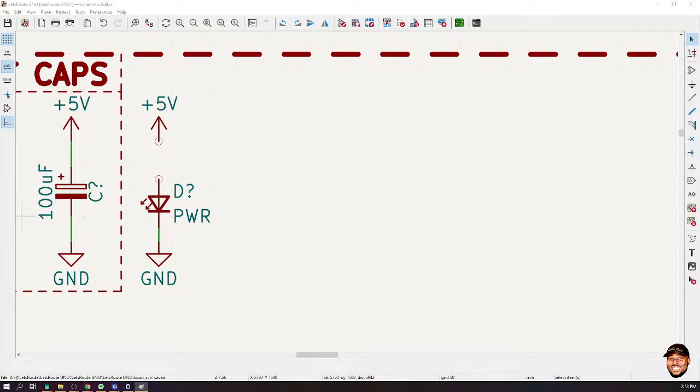Fortunately, we know what voltage should drop. That is our 3 volts. And we know how much current we want to pass. That is 10 milliamps. What we don't know is the resistance we should choose. So from maths, we make R the subject. We get the resistance equal to 3 divided by 10 milliamps. Milli goes up and becomes a K, so 3K? Please confirm this for me. No, 10 shifted, that's 0.3 times a K. So that would be 0.3K, which is 300 ohms.